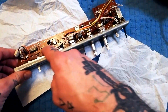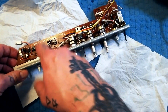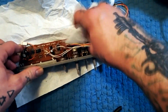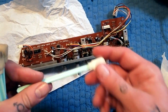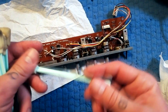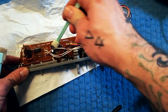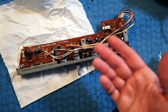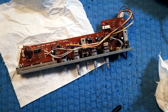You may have blown a bit of the contact cleaner onto the PCB. If so, you can get in there with a paper towel. I've got these foam oversized Q-tips intended for cleaning a computer printer — that's good for mopping up the excess. The stuff will evaporate if you leave it long enough.